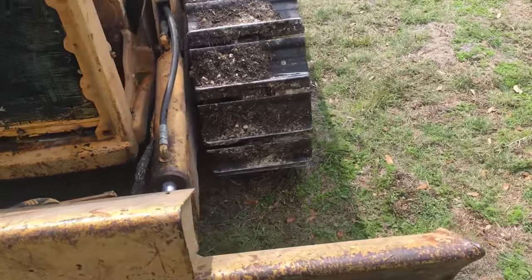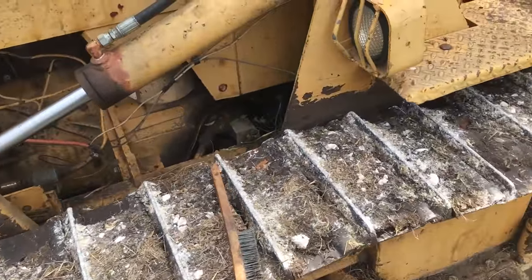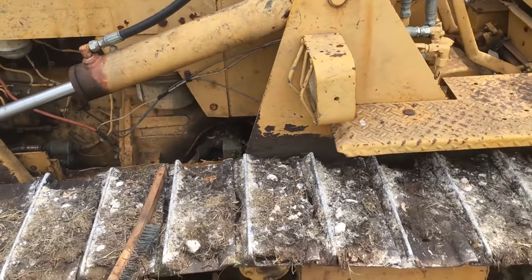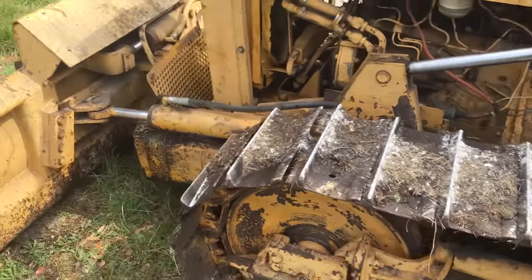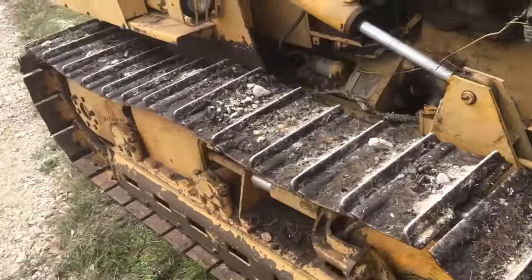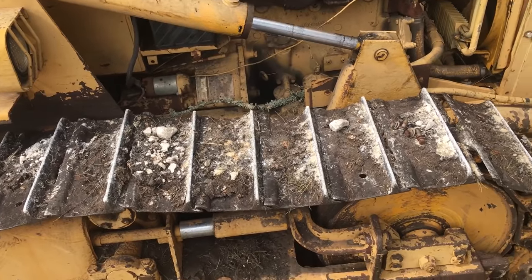But like I said, on this old machinery, and even the new machinery, especially things with turbochargers, you don't want to just pull up, even your pickups, you don't want to just pull up after a long, heavy haul or a lot of work and just shut it down. It heat soaks the engine real bad and can either distort something, warp something, or you can end up locking something up, or just premature wear.